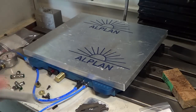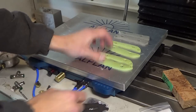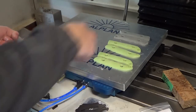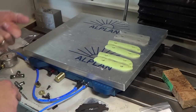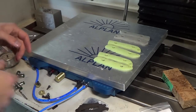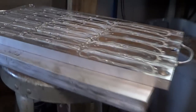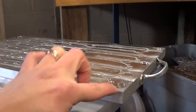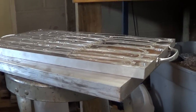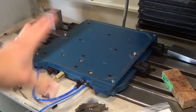You can have two pallets per set of parts. Say I'm making these G10 Tor handles — I could line up one pallet with bolts and rows of them. Once this is done machining, I can pull this pallet off and put another identical pallet on with another row already attached to it. Pallet changes will be much quicker, production will be faster, and it's just another cool fun toy to play with. Right here is the pallet I used to use to make my Norseman handles and pocket clips, and underneath it I've got a new pallet — just a raw piece of aluminum. My old pallets were three-quarter-inch thick; this new one is one inch thick because the blue VacMagic is only about 14 inches wide and my pallets are 18 inches wide.